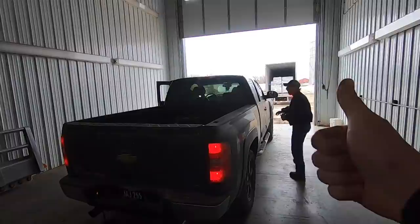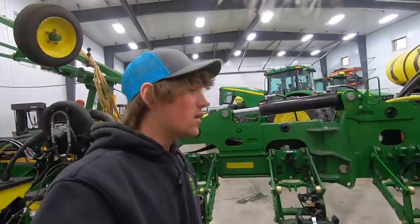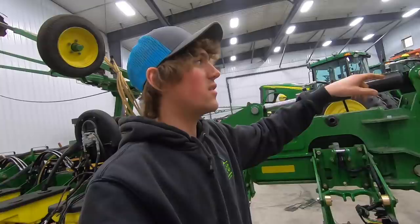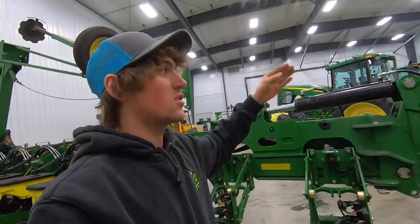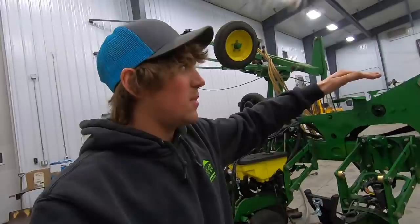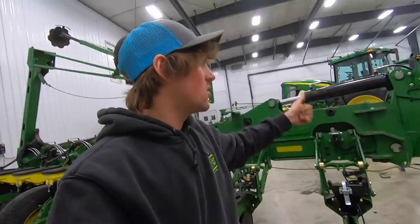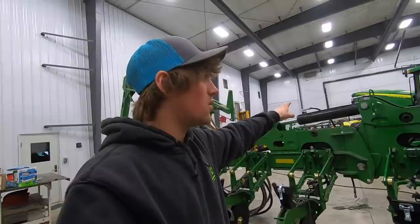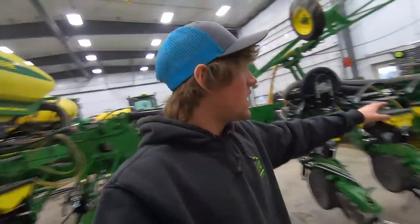Lights are on — ready for Iowa. Thanks for coming, guys. Have a safe trip home. Thanks for doing a good job. So there you go — this kit is completed except I have to run some hoses from the precision box to energize it, which just needs continuous flow. The gauge says 800 to 1000 pounds is where you want to keep it, and it will continuously maintain that pressure to the wing but still allow flow back. So if it starts pushing up it'll keep 800 pounds of pressure on there but still flex — it just returns the extra oil. You continuously have that flow as long as you're in plant mode.